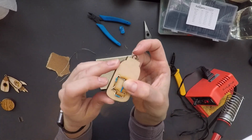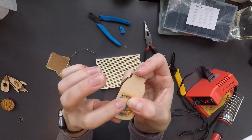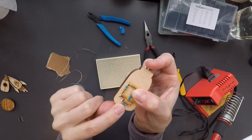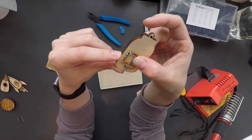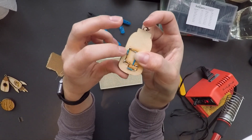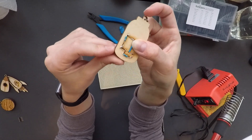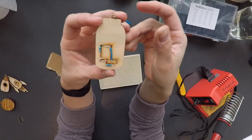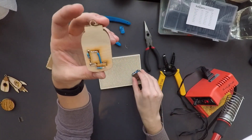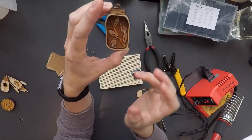So I was trying to dig out a little bit more space for the resistor so it would sit a little bit flatter. This one isn't affecting the circuit board at all, but this one definitely is. I think I'm just going to have to deal with it being a little bit higher than I expected, but all of the wires line up now. So I'm going to go ahead and solder my circuit board onto there and try it out and make sure that that circuit works before I finalize the LED design.